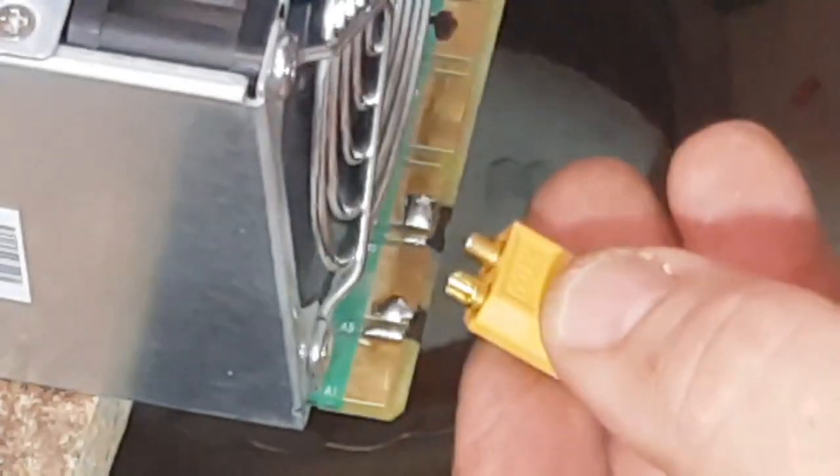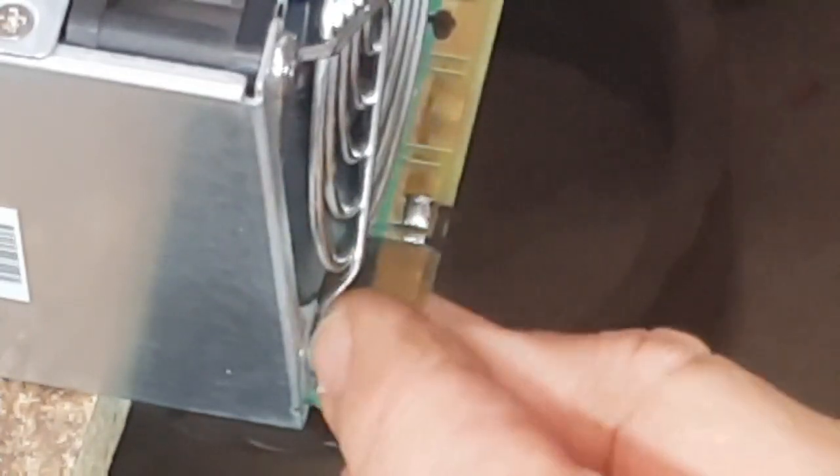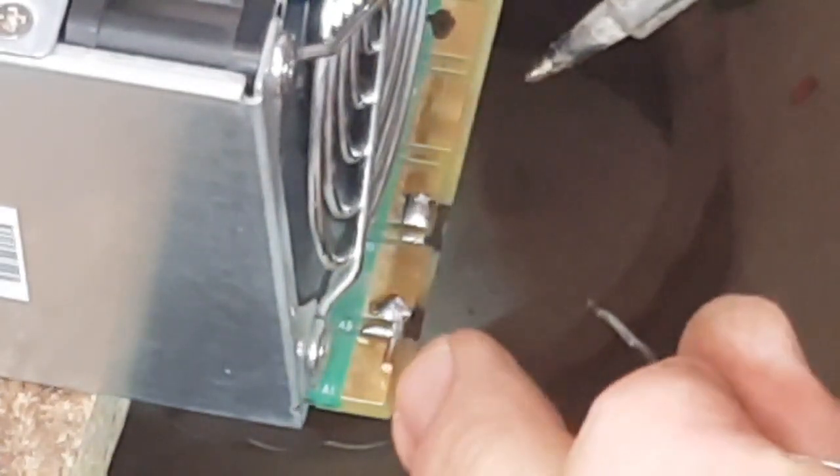As you can see here, this is the ESP127 — the power supply number is PS5501-1, revision 4. I'm not going to put that on there, I just need to put some copper bus bar across it. I'll just solder that onto there and then cut the rest of it off. You're better off to have a longer piece than a shorter piece because there's not much room there to work with.